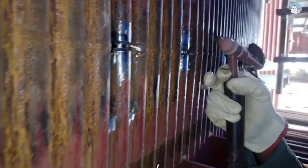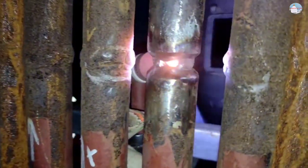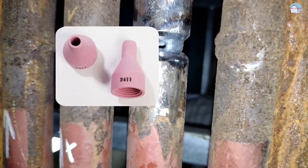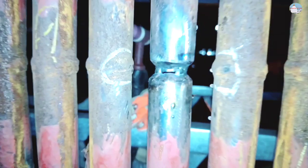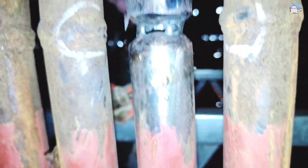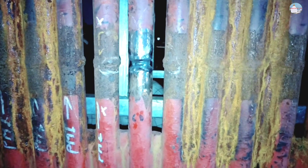Look friends, this joint is the side water wall panel. For this joint, we used a nozzle — it was a ceramic nozzle, 24-11 — and when you put the gas in, we kept the gas at 8. If you want, you can also weld it from 24-13, but you can weld it from 24-11 because it will go a little further. We used the filter nozzle for the final. You can also weld it from 24-13, or weld it from 24-11 and use the filter nozzle for the final.